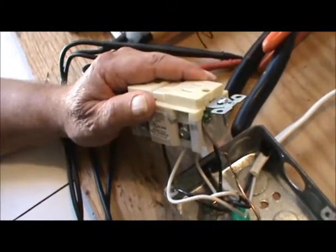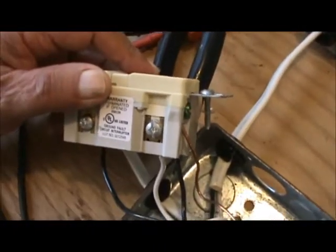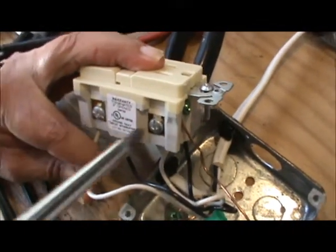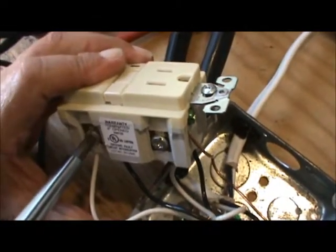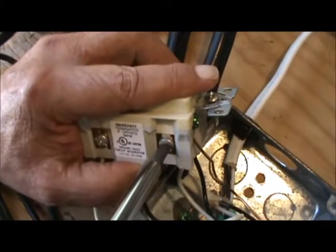This is a common thing that happens when people wire houses, and a lot of times people just don't pay attention to what's going on. When we put wires in a box, we would take and skin the tips of the ones that need to go to the line side of the receptacle. That way you always knew which one, because a lot of times you don't have power on your receptacles to test the wires — so you'd have to tone them out.